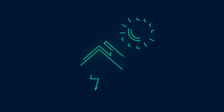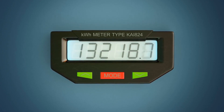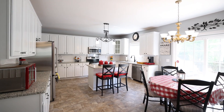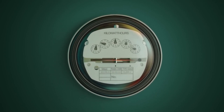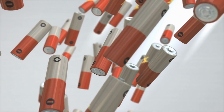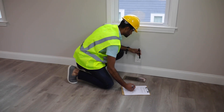The first step in sizing your off-grid solar system is to figure out how much electricity your household consumes every day. Every appliance you use, from lights and fans to refrigerators and TVs, draws a certain amount of energy, measured in watt-hours. To do this, you need to create an energy audit. Start by listing every device you plan to power, along with how many watts it consumes and how many hours per day it will run.